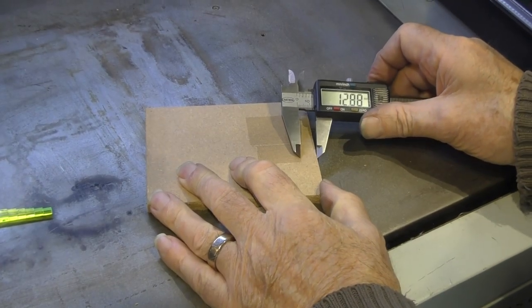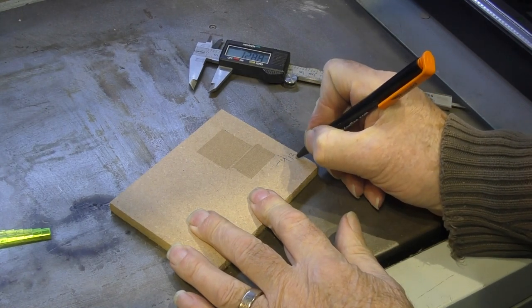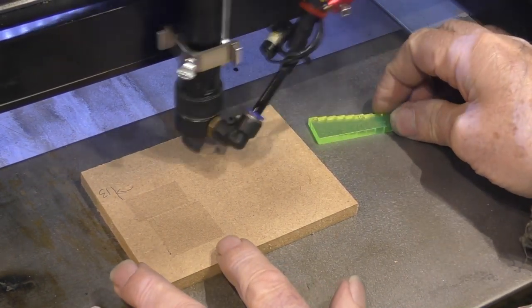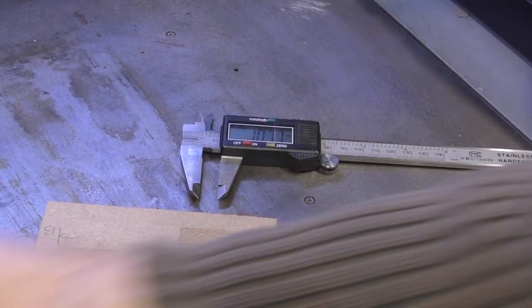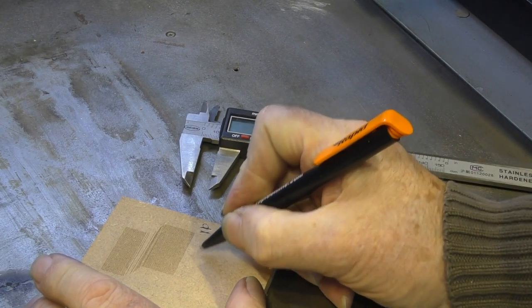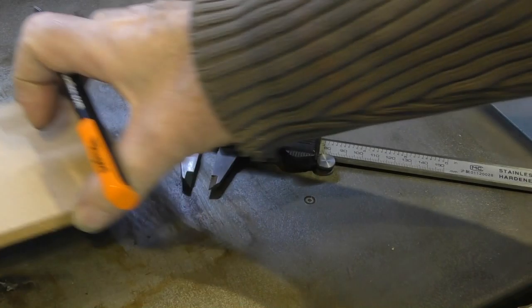So there we go. So now we've reduced that to 13 millimetres. How much faster can I push the machine? This is 20,000 millimetres per second acceleration. And we're now down to 10.7. I don't think I'm going to get a lot more advantage. Basically 11 millimetres, let's just say. Let's not be too fussy. I mean, we've halved the amount of overrun on this machine.